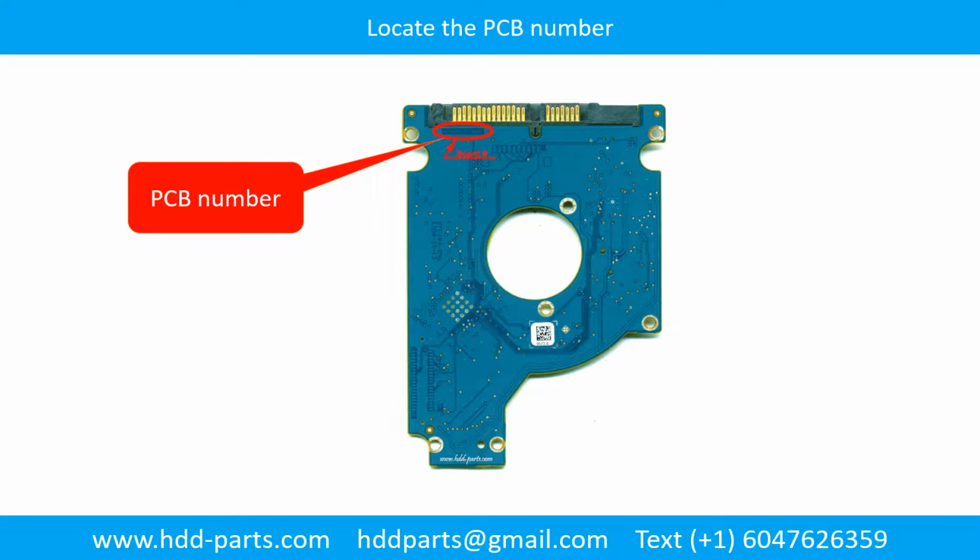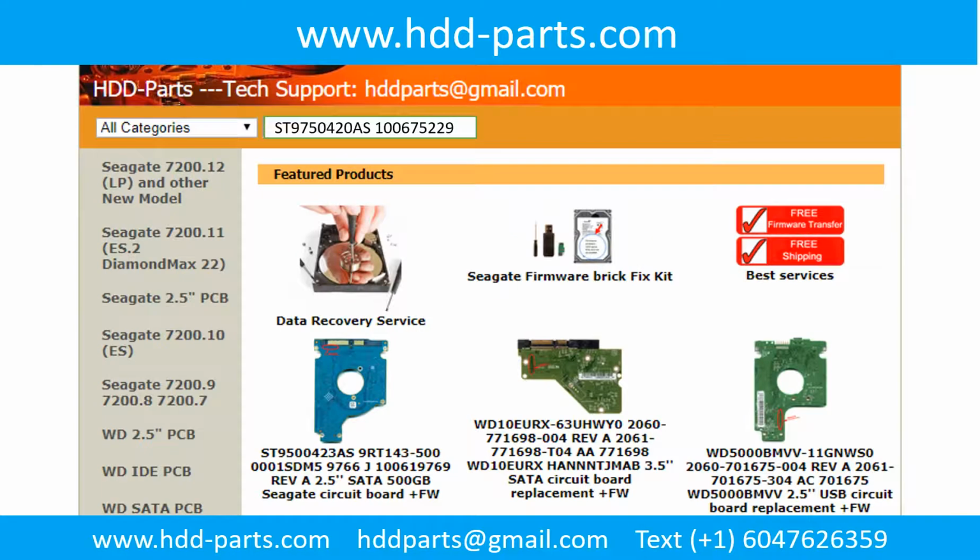If you have difficulty finding out the PCB board number of your hard drive, you may go to hddparts.com, input the hard drive model number and some information on the PCB board to find out a similar hard drive and a similar PCB board number as a reference, so you can eventually find out your PCB board number. After knowing the hard drive model number and the PCB board number, you may use them as a reference to search for the correct donor board.